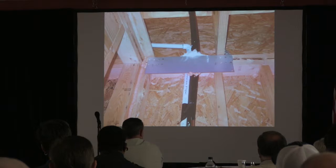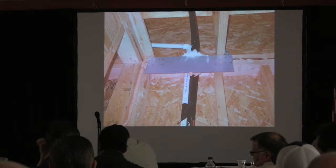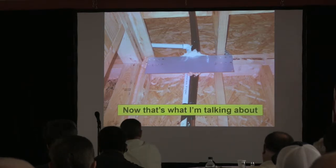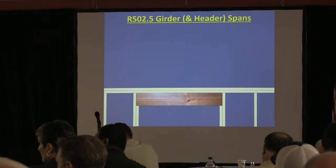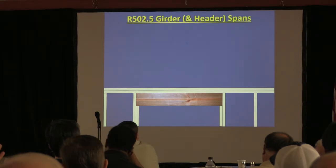It's a lot cheaper to put a strap in. Okay. So just because we have continuous structural OSB sheathing on the outside and you've notched the inside of it, it doesn't count. Exactly. I had forgotten about that code. I guess there's some time when you would have to stack going up from the outside or something. Somebody might have cut it out there before they finished sheathing it. It's usually though, the framers are out doing most of their stuff anyway before all the trades come in and do their work.